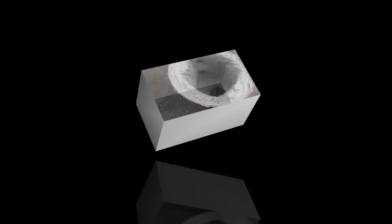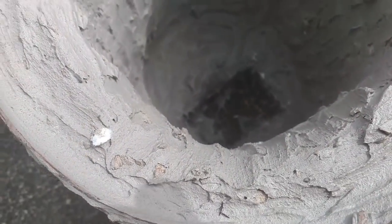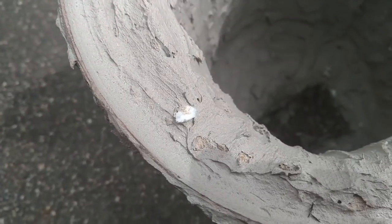So, replace the flares in there, as you can see. Got some mud in here. This is just the first coat. The second coat, I'll smooth it all up. Tell you, it's real tough to get this stuff on there without it falling off, so you get it on as best you can on your first coat.